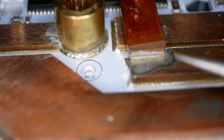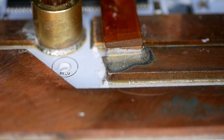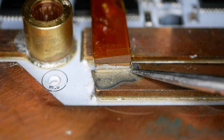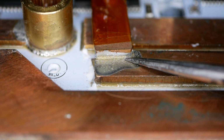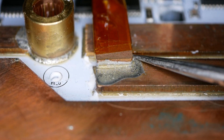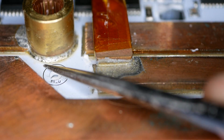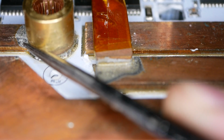I would definitely like to see more solder on there. This one here is about the same. Let me get the camera to focus on it again. There we go. And actually it's a little bit worse. So you can see a little bit of a crack right underneath this part here. So that one is definitely starved more. And you have a little bit of transition over here, but not very much of one. Yeah, this is still starved. I definitely would like to see more solder on here, so you get that nice gentle curve like you see here or here. This is nice and ideal.